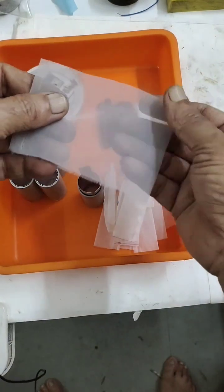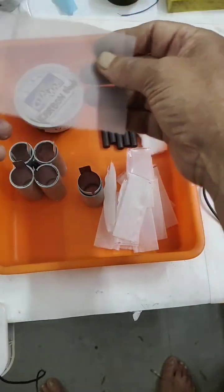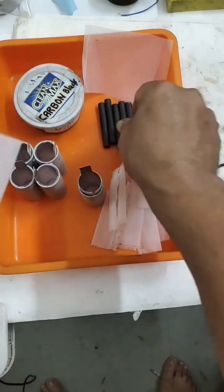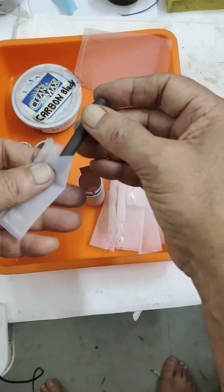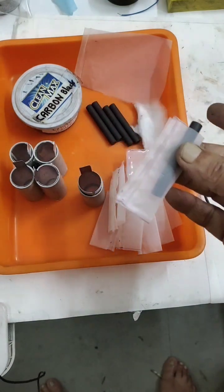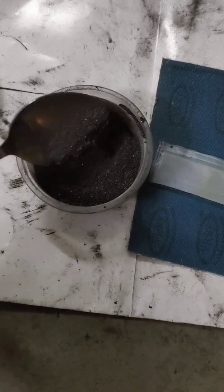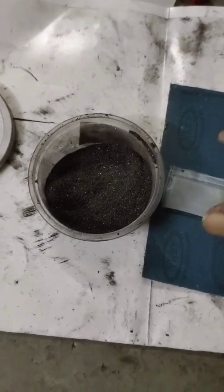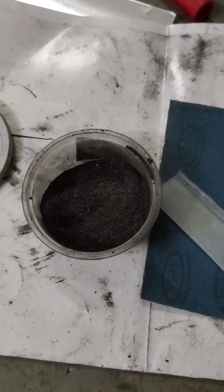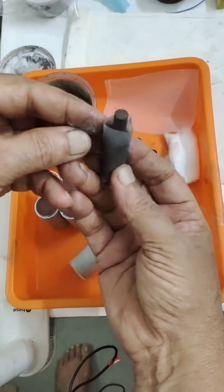You can see the filling nylon bags — just a nylon cloth. It is available for screen printing; the same 500-mesh cloth, which they call fine mesh. I cut the filter cloth to the appropriate size and make a bag using a sealing machine. After sealing, I insert the carbon rod so this gap will fill with the metal oxide, graphite, and carbon mixture.